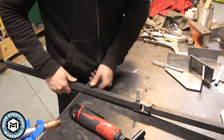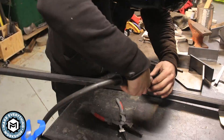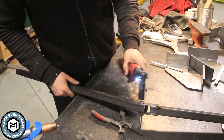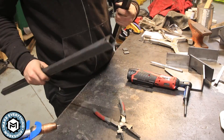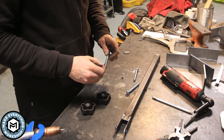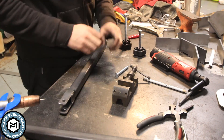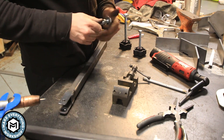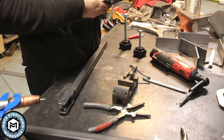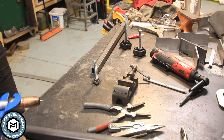I'm using a 3/8ths inch weld nut that I got from McMaster Carr here. Weld nuts are just a non-coated steel nut with some little tabs so that they sit nice and flat. If you're going to do anything involving hardware, I recommend that you just buy maybe 25 weld nuts. It helps you from having to grind off the zinc and you don't have to breathe in that horrible coating if you weld regular hardware store hardware. I also got these 3/8ths-16 thumb screws — rubberized and plastic knobs from McMaster. What I did was I just took some red Loctite and put it on them so that they would basically turn into a post with a knob on it. And while that red Loctite is drying up, I can continue to work and weld another nut to the bottom side of a 1x1 little piece of plate.